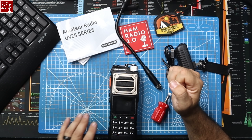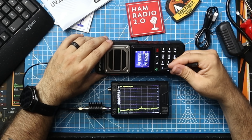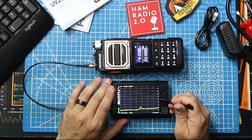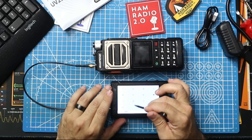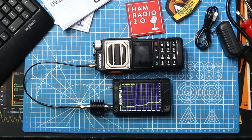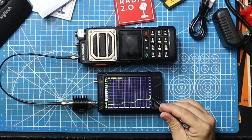I want to put this on the TinySA and see what happens. We've got the frequency mode here, VFO 146.520. I'm going to go down to the bottom band and change it — it's still in memory mode. Long pressing the green button changes it from VFO to frequency mode. I'll change that one to 223.500. Now we're going to set up the TinySA. I'm going to go to measure harmonic 146.52 times one. Level minus 40. Someone said in a previous video that there was a harmonic on the edge of the TinySA without me keying up, and I guess that's what they were talking about.